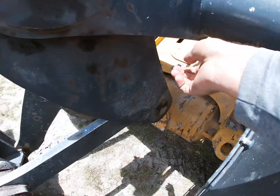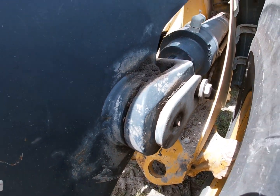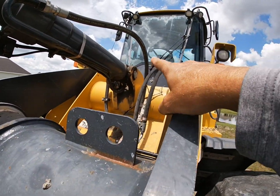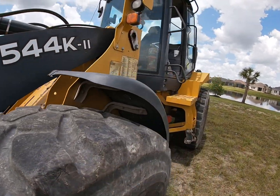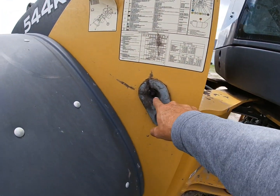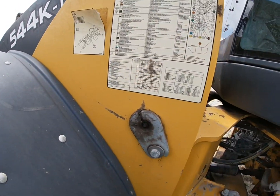Same for this fitting — that grease fitting is going to be on the back side over here. These main boom cylinders on both sides, and then up here you'll have a grease fitting on the top of the boom and the top of both of the arms. That's the front. Coming on to the back, here's where we grease the rear part of that hydraulic cylinder that's lifting the main arm.